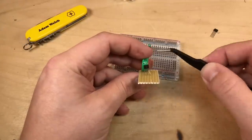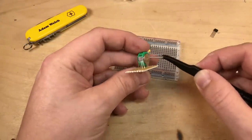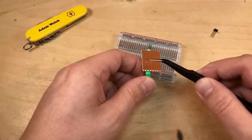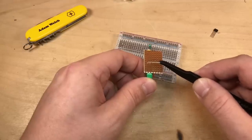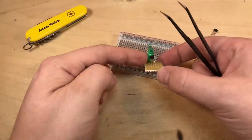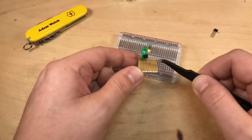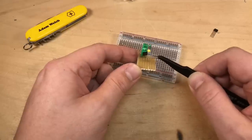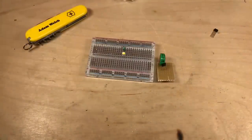Now, I am aligning this slightly different to how I had it on the breadboard, but pin 3 of the YX805 here connects on this line to the negative side of the cell, which means the positive is sat on this one, and, well, that's not actually connected yet to pin 2, so I need to put a jumper in there because the battery is wider than the legs on the YX805, which of course isn't really made for this 2.54 mm pitch here. It's half of that, so I've had to splay those legs, but yeah, we'll make it work. So there we have it.